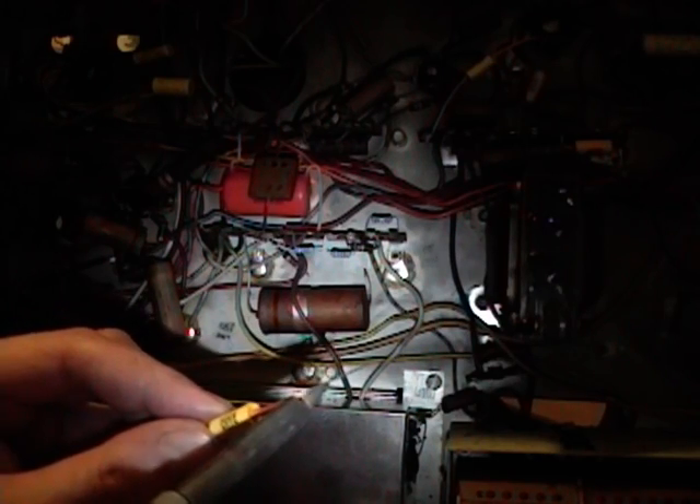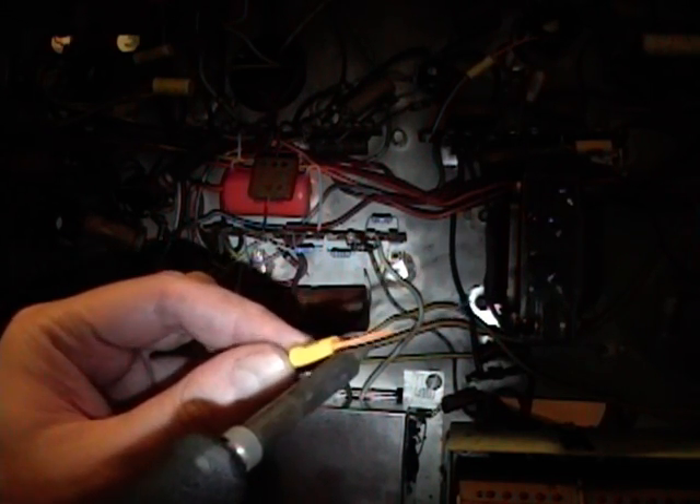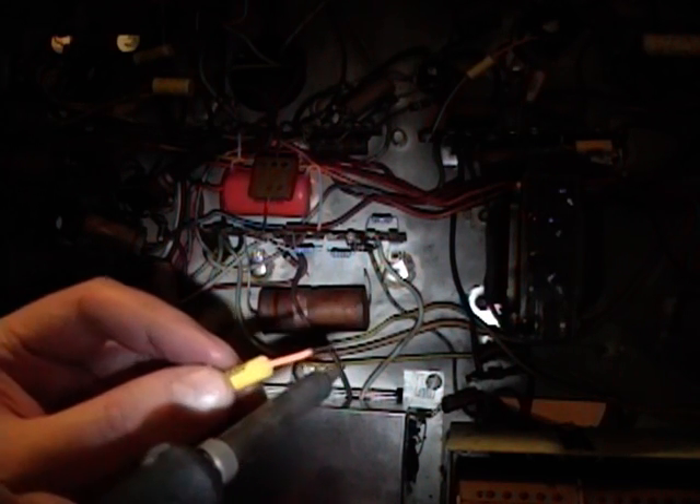So I cut off a little bit of tubing — this particular tubing came as a courtesy when I ordered my capacitors, otherwise I buy big rolls from Mouser Electronics. Usually about an inch or three-quarters is how much I need. To shrink it down you need to apply heat — you could use a heat gun or a lighter. I use the most convenient thing on hand: the soldering iron. I use the little joint where the tip meets the body and rub it along, or just hover it right below. You don't want too much contact or the stuff actually starts to melt. And I suggest putting the heat shrink tubing on before you do any bending of the leads — it'll make it a lot easier.